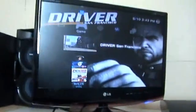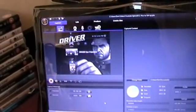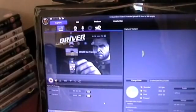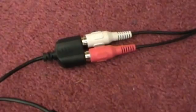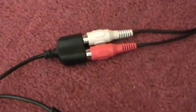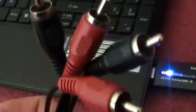Pan the TV around and you've now got signal through your TV and signal in the capture card at the same time — literally as easy as that. For audio, you need two Y audio splitters and two sets of red and white extension cables. Note that if the cable is actually splitting and losing quality or going into mono, you need to upgrade to a better splitter if you want the best audio.